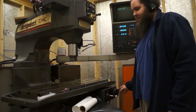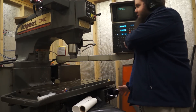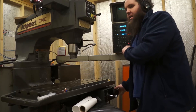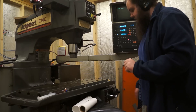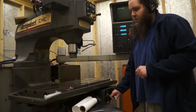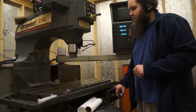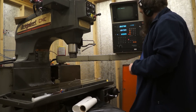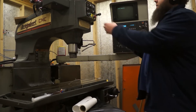There's the spindle. The other thing is these units go down to a thousandth of a millimeter, which is kind of amazing. I don't know if it can servo to any of that, but it's really precise. I can also put it in manual operation mode. I'm not totally certain what's going on here because I believe this knob — the rapid control velocity knob — should affect the speed of all of the traverses, but it only seems to work for the quill.